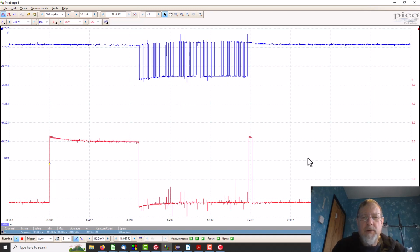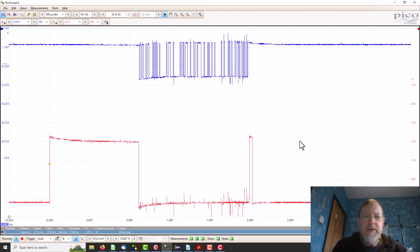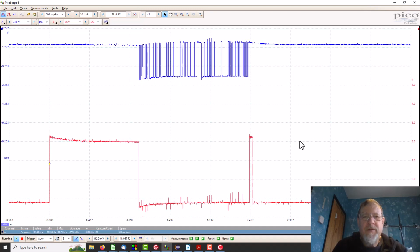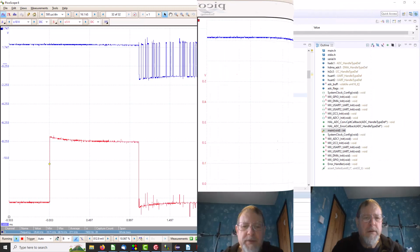We can use a higher baud rate for the serial, and we can use the interrupts or the DMA for the serial, so we can be outputting the last serial values while it's reading the new rotation values. And it probably reads too much from the rotation sensor. Anyway, we know we can speed it up if we have to, but probably not more than to 2 millisecond update. However, for now we're going to see what we've got, see how it performs, and if it's not fast enough, then we're going to have to speed it up.